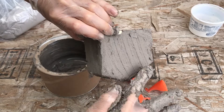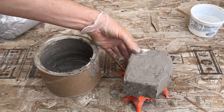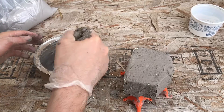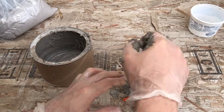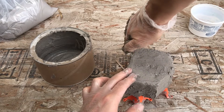If you do coat a plinth, one thing you want to make sure is that the surface resting on the furnace floor and the surface touching the crucible are fairly flat. I might be stating the obvious, but it matters.